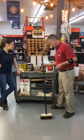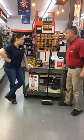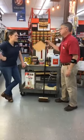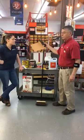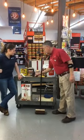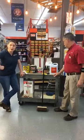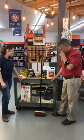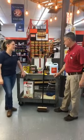What happens if you maybe dig a little too hard and you gouge your wood? If it was a softer wood, fill it with wood filler? You can. There are interior and exterior wood fillers. And then sand it back smooth and move on. Just keep going. Don't stop. Fill the hole and go. Yeah. Just make sure you get outdoor if you're going to do outdoor.